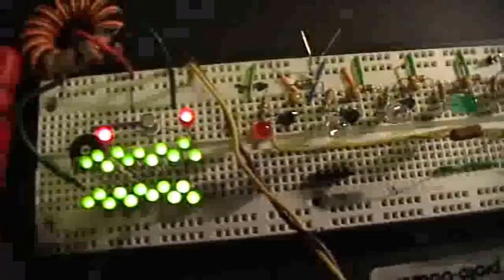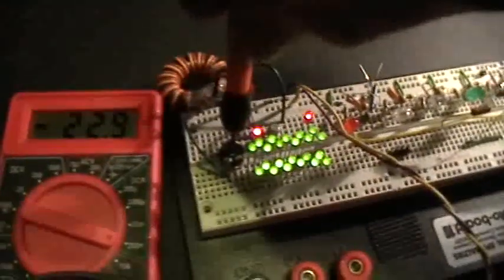You can see that all of those LEDs are glowing just as brightly as can be. We've got a high current drain — 81 milliamps. If I turn it the wrong direction, we saturate the transistor and get way high current drain. But if I go the other way towards increasing resistance, I can get that current drain down pretty low before you start getting visible dimming in the LEDs. With 10K of base resistance on this one-to-one toroid, we're drawing about 23 milliamps from a 2-volt source — around 40 milliwatts — and we've got 24 LEDs lighting pretty bright.